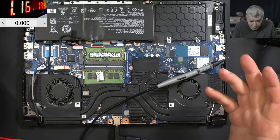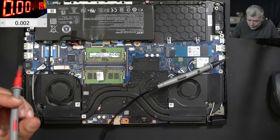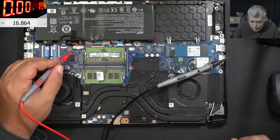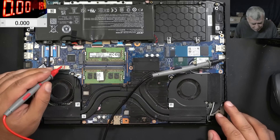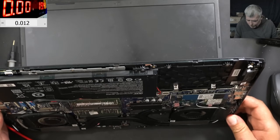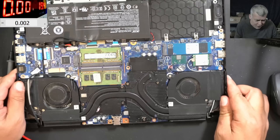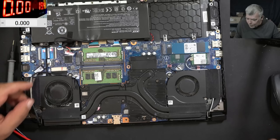Based on the fact it's taking like 1.1 amps, probably the battery is fully charged. The battery voltage is 16.8 — yes, it is fully charged. So the laptop should come on and work fine. The EC chip has voltage. Pressing the power button — nothing happened. That proper sucks.